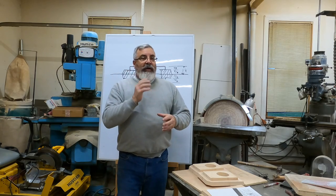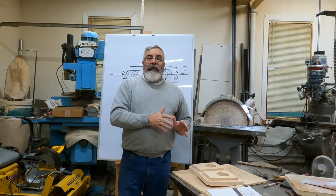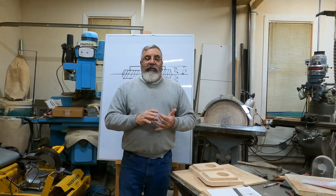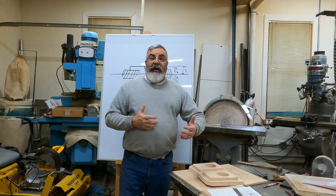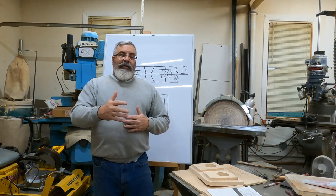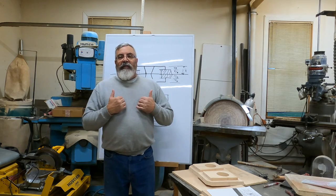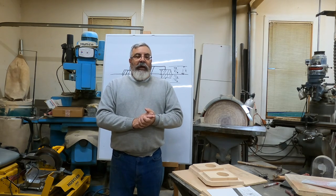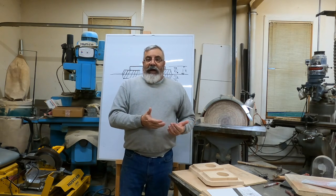Another thing real quick, too, I keep on going off on tangents here. Another thing in determining how to build a pattern for casting. The foundry is a big consideration. Sometimes it's lumber, what kind of lumber, your availability of certain lumber, the expense of if I got to do it urethane, do I got to do it this way, that way. And it's easier for me because I have machine experience. I did a lot of time on machines. So another thing you got to determine also is the machinability of the casting when it's done.